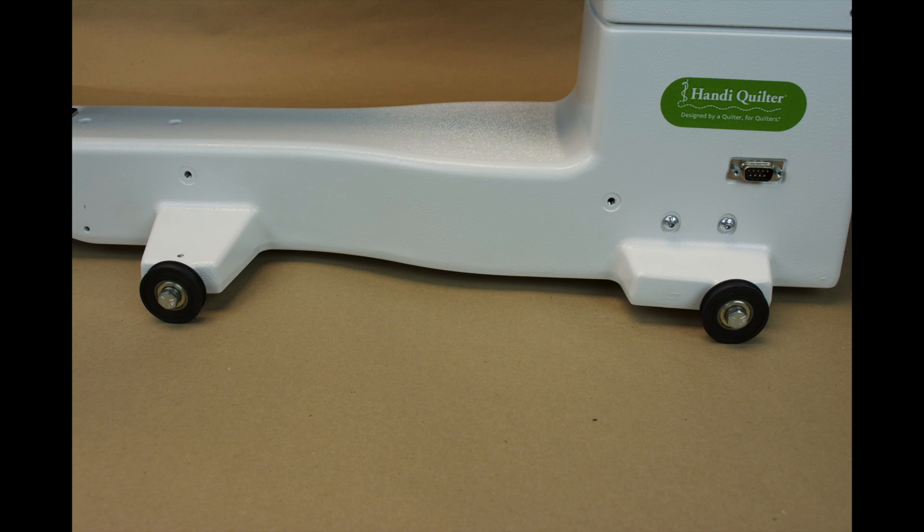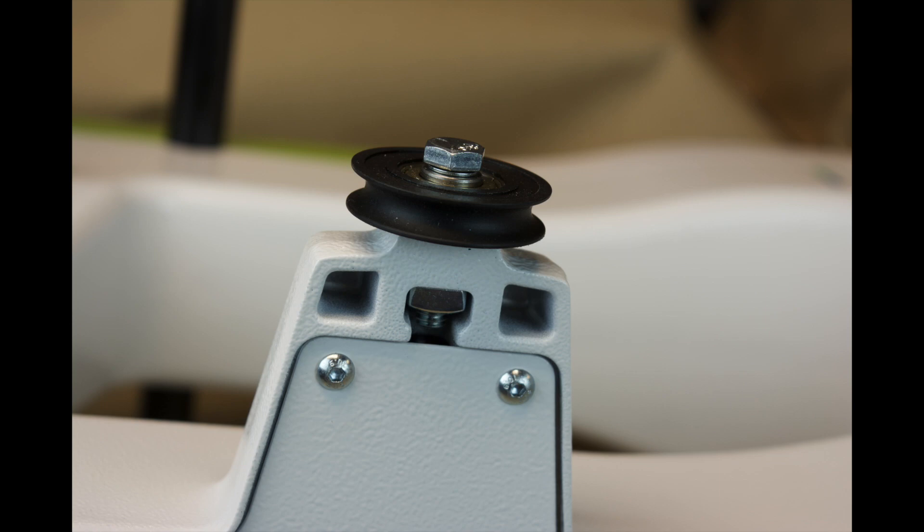Now it's time to mount the Y-axis drive assembly to the sewing machine. We first need to mount the Y-axis drive motor bracket to the sewing machine. With a helper, tilt the machine over so it is lying on its side. The front wheel attachment looks like this. Remove the bolt holding the wheel to the machine — there is a square nut captured in the sewing machine that may fall out when the bolt is removed, so be ready. Remove the bolt from the wheel; there is a thin washer or shim on either side of the wheel. Do not misplace those washers — we'll need them in the next step.